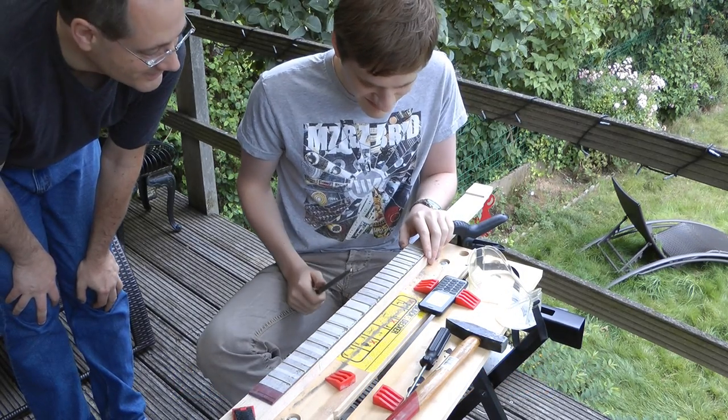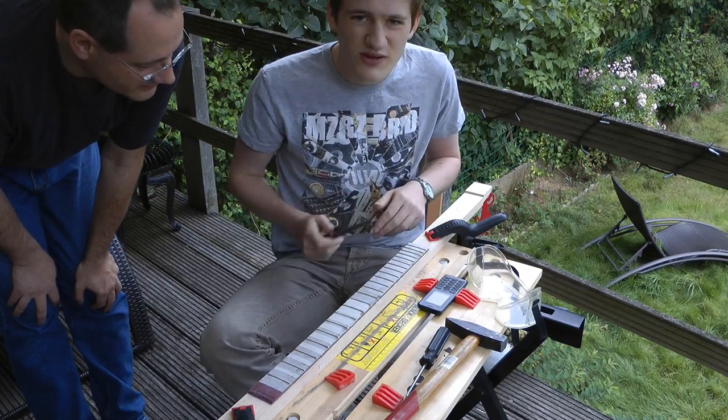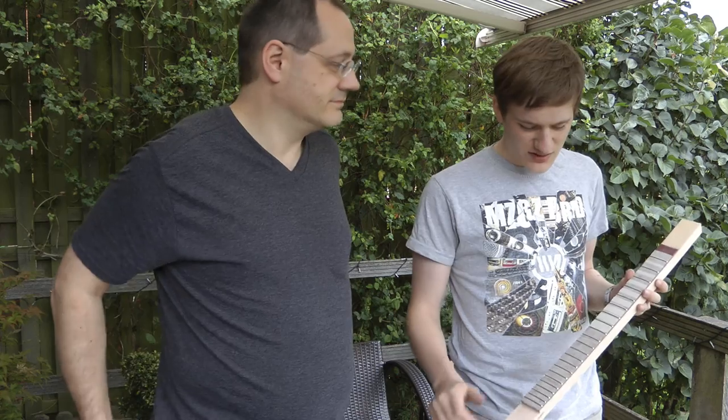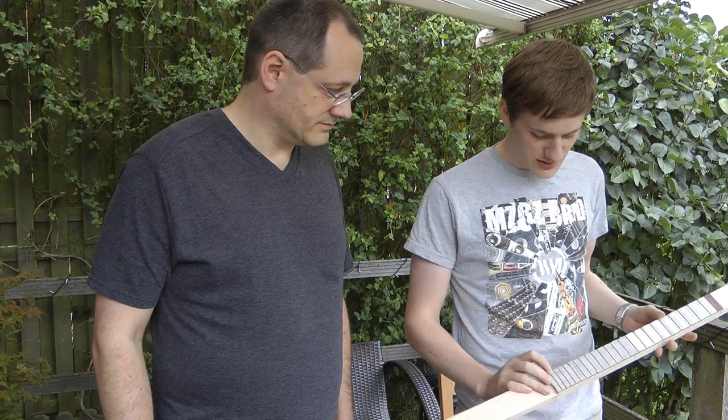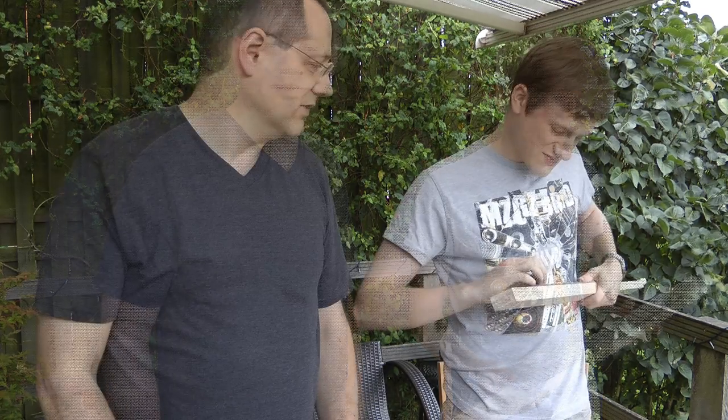Okay, so I've been out for a walk with the dogs and you've been busy here. Yep — we've got this side done and this one down to here, just got these last two to do and then just tidying up. So what have you actually done? Round-up: about what we said we'd do — finished radiusing the fretboard and then got the frets in and filed down to fit nicely. End result, quite nice. The frets aren't levelled yet of course, but we aren't planning on doing that just yet. So there are still plenty to do, but that was good progress today. It's all gone well, no major mistakes or anything. I did occasionally bash into the corners here, but they haven't been rounded yet, so I'm not actually worried about that. And the fretboard itself feels very smooth and very good.